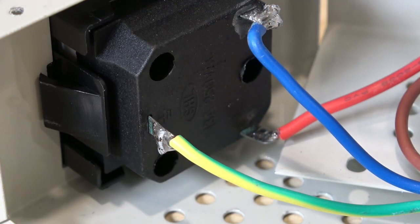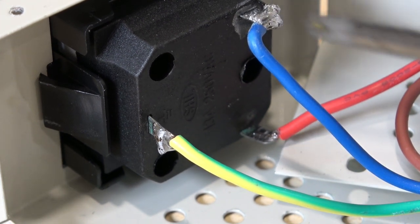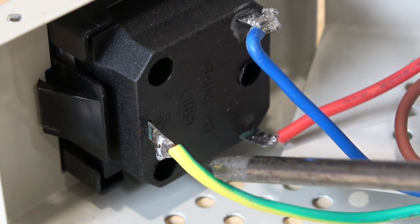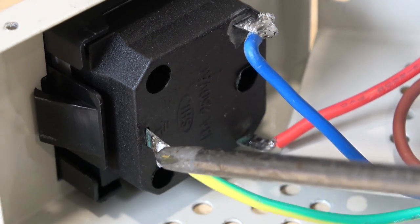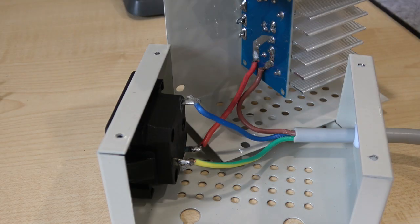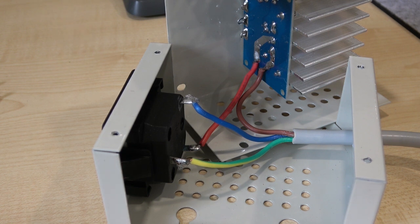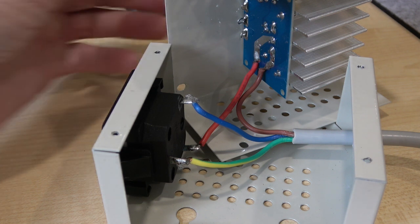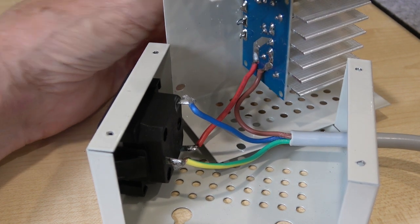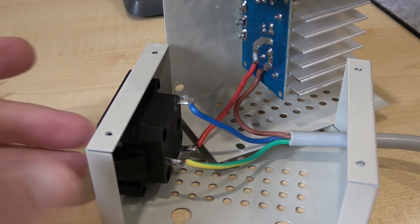Soldering at best is poor - these joints here have been done with a cold soldering iron. They do seem to be actually making contact, but poor soldering. There's no on/off switch whatsoever. In fact, as soon as you plug into your supply the whole thing is live, and it's off only in so far as when you turn the potentiometer down you're getting limited output, but there's no isolation to this external socket at all.